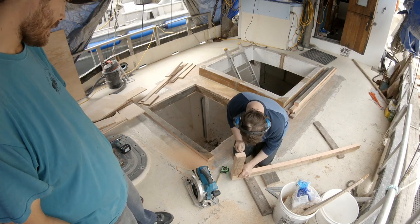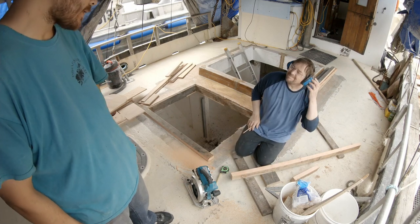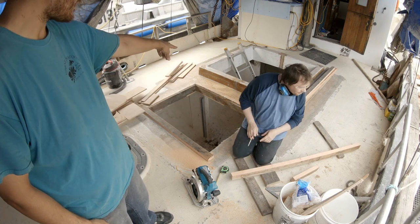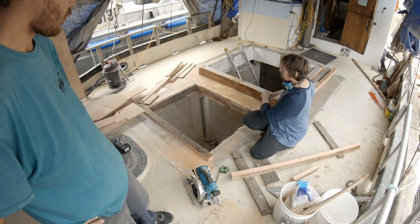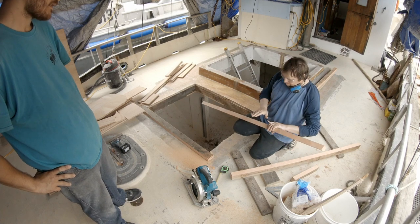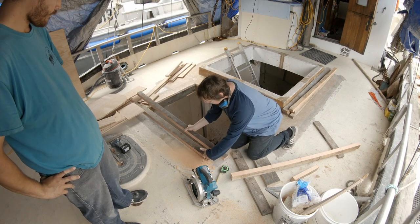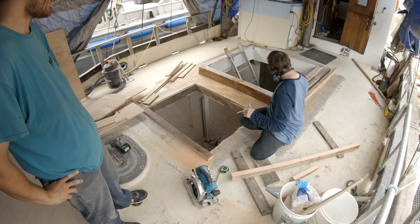So Dad's just notching these 2x6s, which are now cut down basically to 2x4s. One side is for the bottom, the other side of the cut is for the top, similar to there. It has a taper on that coaming, comes up like that. So it works out quite nicely. We were able to just put our angle on here and split these 2x6s, so it'll be kind of like that. Put a piece of skin on the outside. Pretty efficient, skin, actually.